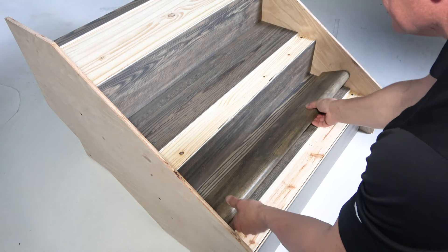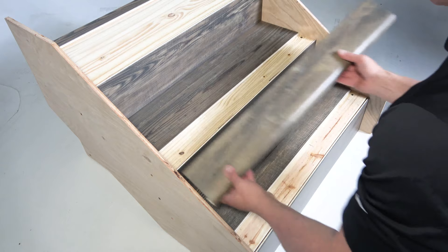Fully adhere the flooring and risers on the step using the appropriate Shaw adhesive in accordance with the instructions on the pail. With the riser and step fully and permanently in place, you're now ready to install the flush stair nosing.